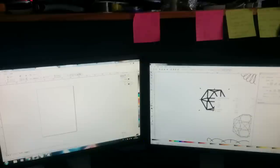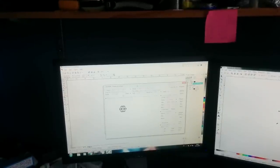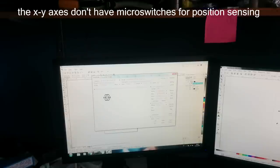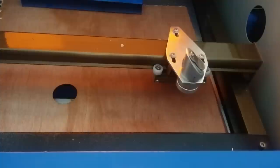In this CorelDraw plugin you can just click cutting and you're greeted with the cutting window. The image here is what's actually going to be cut out and you can move it. So if you can hear the laser cutter moving there, it's actually the laser head moving. So you can set it to wherever you want. The laser is on - I'm setting the power to 60% because I know that works quite well on this plywood to cut through it. I'm just going to go over to CorelDraw and click print and it should work away. I'll leave the door open.